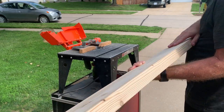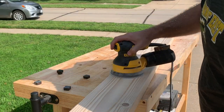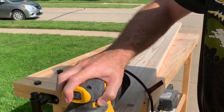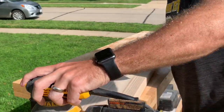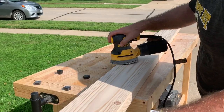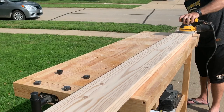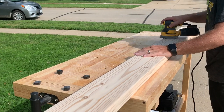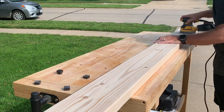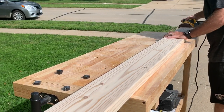There were a couple of spots that didn't match up well because it's construction grade stuff, so I used the sander for that. I started with 80 grit to get it roughly smooth and then went down to 120 grit on each board. I did not go to 220 on this project — I knew we were painting it and it turned out fine at 120. I made sure to go over the edges with the router again because we knew that little fingers were going to be grabbing it, and I sanded all those edges and corners real carefully.